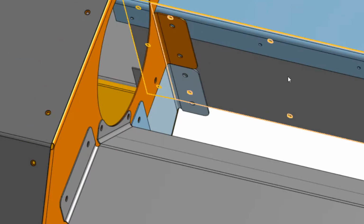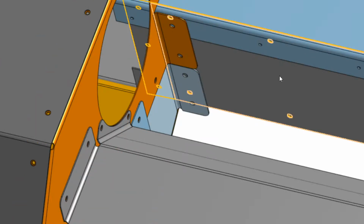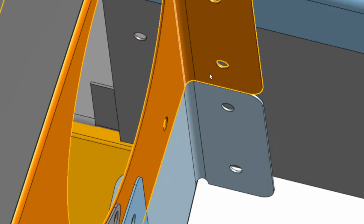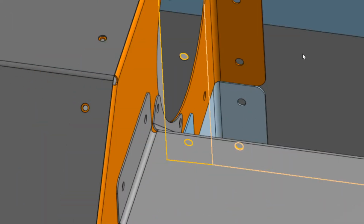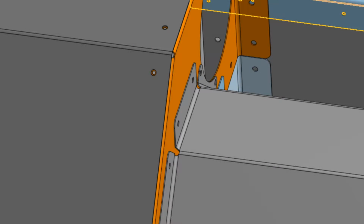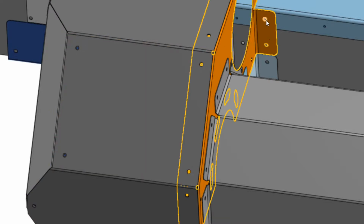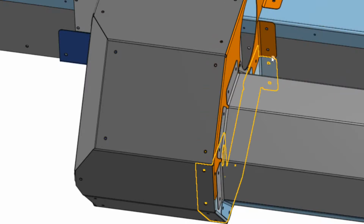and that's because I'm using the same pieces back here from the later tin design for the later models. And so on this one, this sidewall moves to the right here from where the previous one's attached. You can see there's holes back in here in that tin that will be unused in your kit, because we're moving this sidewall around the exhaust turbine to the right. And there will be holes in the flanges here, but because I'm not sending you a new side cover for your manifold, there won't necessarily be holes in this flange and this cover to match to these, and so you may need to put this piece in place, mark it, and then punch or drill holes in this for those screws to be able to get in there.